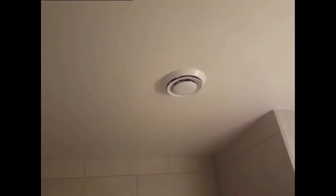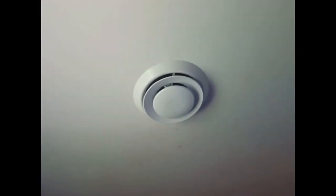There we have our 6-inch conduit and ceiling duct. It's a little less noisy than it was before when I didn't have the Y branch. It's still a little bit loud — I think the inline fan is a little closer to the bathroom than I would have liked. If there was more distance it wouldn't be so loud. This is the Fantec FR200 — it's an older model but wow, what an improvement for getting rid of all the fogging on the windows and mirrors. If you don't want mold or condensation accumulating in your bathroom, go with one of these — it's a good investment.